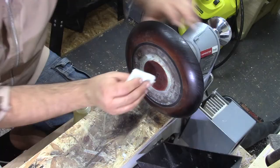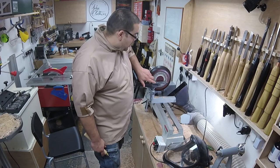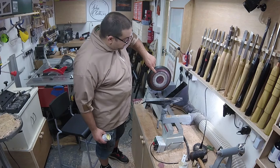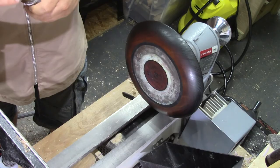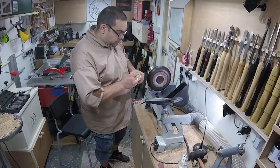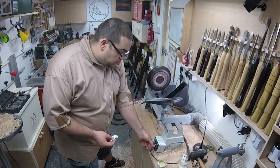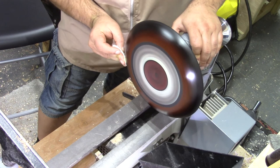Now in order to tie these two bits together I'm going to do a similar thing as I did here with the black ring - just take a little bit of the edge off and then apply some more black. All that's left to do now is apply some wax, and I'm only going to do that to this outer section - I'm going to leave the centre section and not apply any wax over the paint. For this I'm going to use the Hampshire Sheen Beeswax - it's a more old-fashioned type of wax and this is more of an old-fashioned type of bowl. And there we have it - there's the finished piece! I hope you enjoyed watching this. If you did, don't forget to like, leave a comment, share, and subscribe.